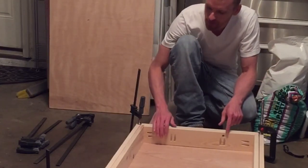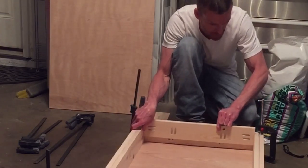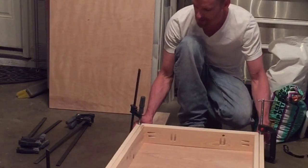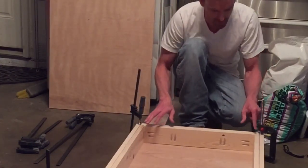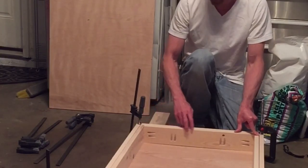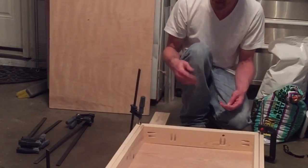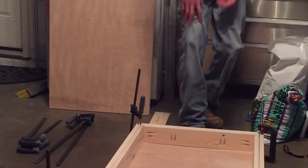This is how I'm laying it out with the side boards and how I'm going to attach them. I leveled all my edges on the 4x4s to my decking on all the outside edges and clamped them. We're going to drill the pocket holes into the inner square and get that all together, then drill them down to the decking and attach the outside boards. That way they close together and it's a lot thinner and more portable.